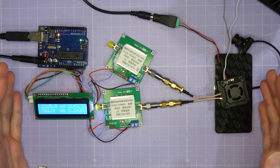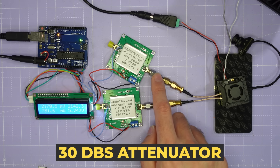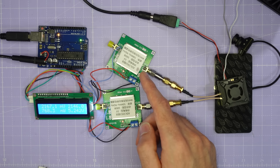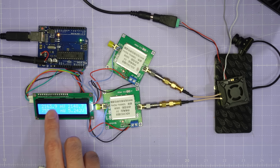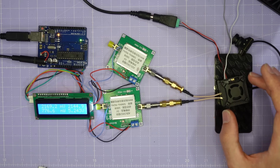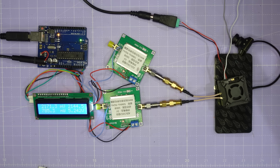Now that we've been through the specs and features on the bench, it's time to show you the test setup for measuring RF output power. We've got the Walksnail Avatar GT VTX here, and both antenna outputs are connected through 30 decibel attenuators into ADL5902 true RMS RF power meters — one for each antenna output. These modules provide an analog voltage output proportional to input RF power in decibel milliwatts, feeding into an Arduino that handles the calculations and displays results on screen. The VTX is being powered from a 15 volt power supply and we have a fan blowing on it off-camera to keep it cool.